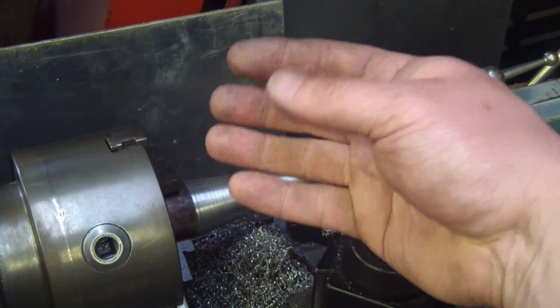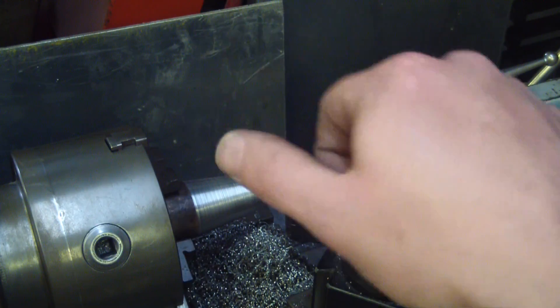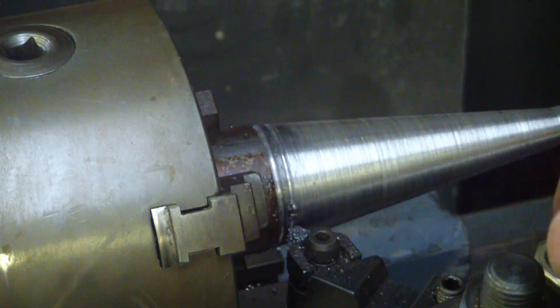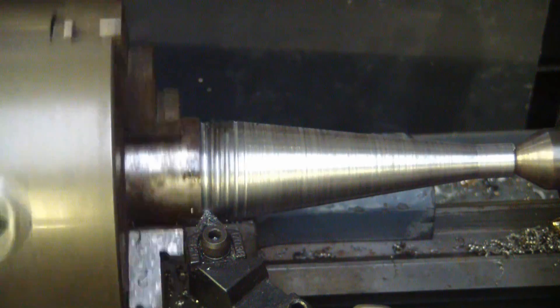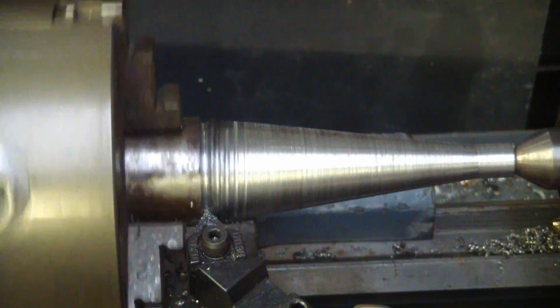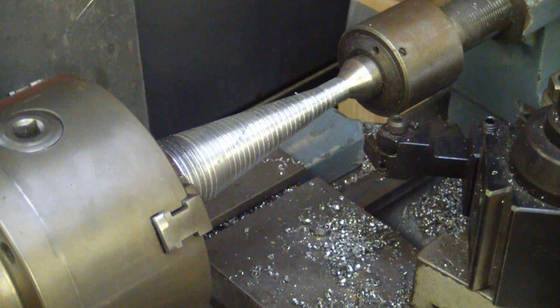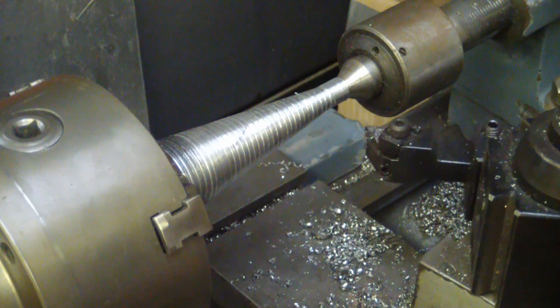I can see now why people invest in taper attachments — my poor thumb muscle is just killing me. And here we got the problem with the baby lathe: there's no torque. Just trying to cut this thread I've got to be real ginger and dainty with it, because otherwise it stalls out even in the lowest gear with the pulley backed right off. So what we're going to do to get that tapered thread is we're gonna do some manual CNC — I'll feed in the cross feed while the lathe takes care of everything else. We're gonna slow it right down because I'm not the sharpest tool in the shed.